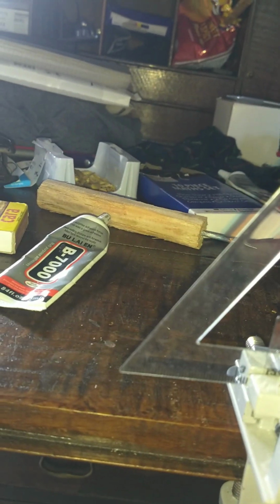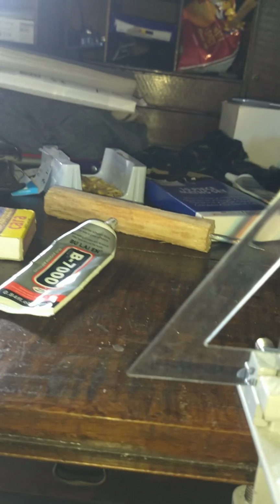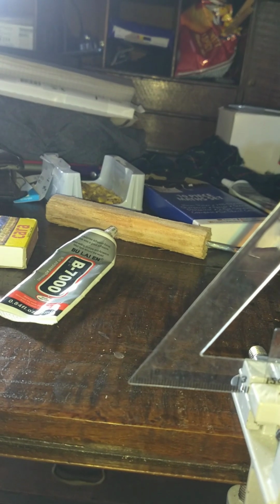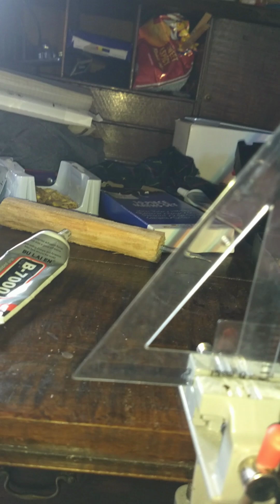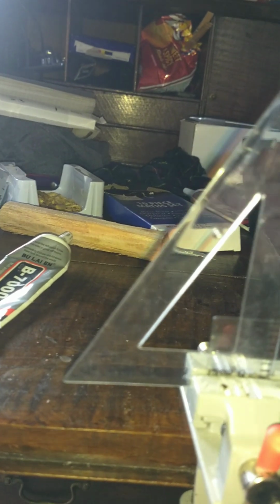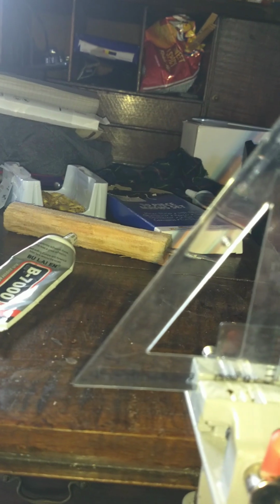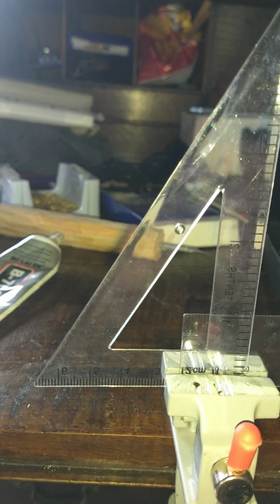I'm going to need 5 of them. I'm going to put first one small pilot hole, then the second a pilot hole, and then finally I'm going to put a third hole, the third thickness of a drill bit for the screws. This is to put less resistance on the plastic and make a more accurate hole for the screws.